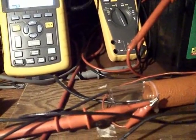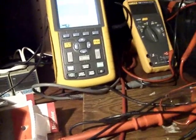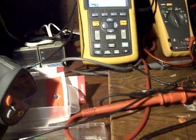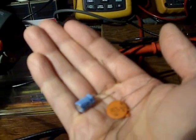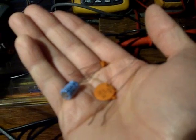Basically, this little video was just to address the point that was brought up to me — that somebody or some people are thinking that the negative effect is coming from the capacitors on the 555 timer circuit. For example, these kind of caps. The blue one is like a 100 microfarad 35 volt polarized DC cap that's typically used as a filter cap to suppress the spikes on the timer circuit.